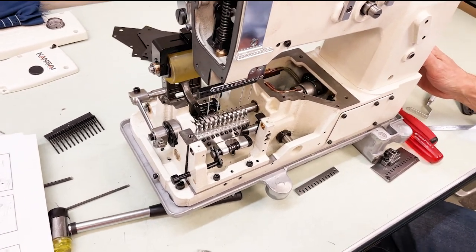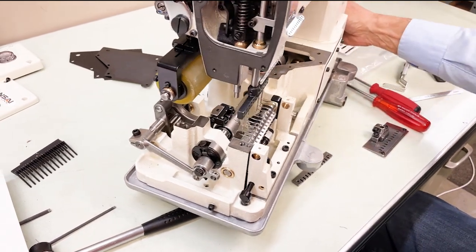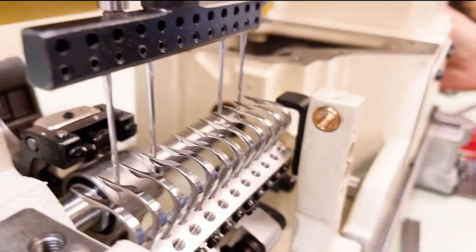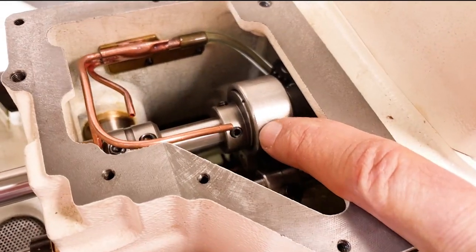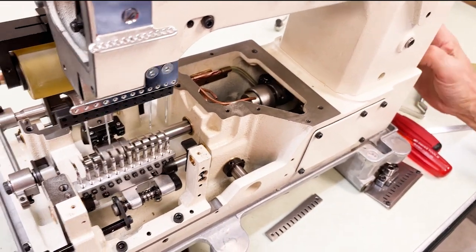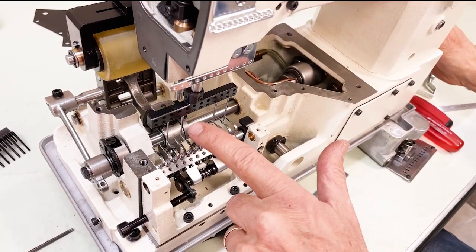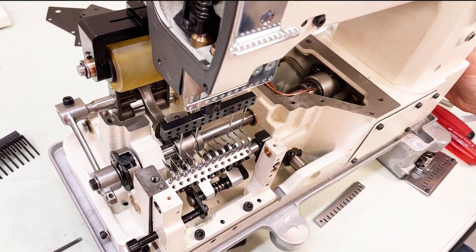If you visit the prior video on DFB-1404/1412, you can see all of these adjustments. If you move the eccentric a little bit, the loopers will be higher on the scarf coming in and lower coming back — for this machine we want them about the same. So the eccentric will slow up or speed up your loopers to achieve equal 4mm timing on both strokes.